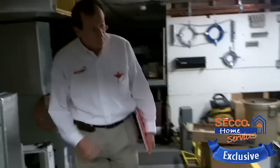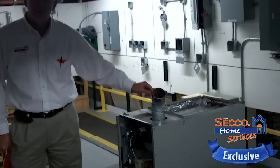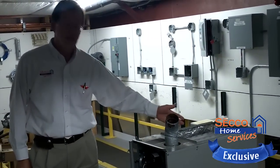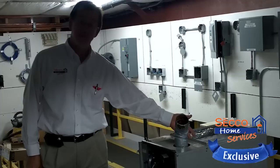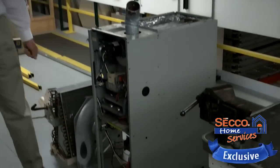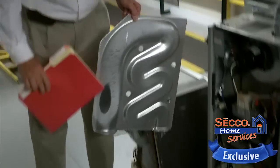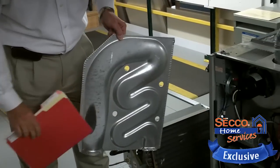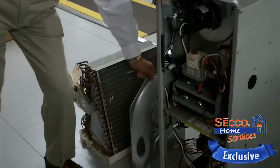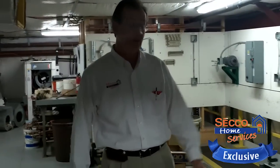This happens to be an older gas furnace, and we take these apart when we bring them back so that a technician has a good visual on what a cracked heat exchanger or a weak heat exchanger looks like. We'll take the heat exchangers out of the equipment and you can see that on this one there's a hot spot here. The idea is to actually show the technicians what they would see if they could take the equipment apart.